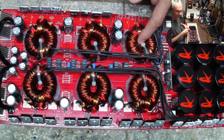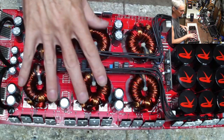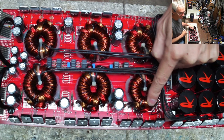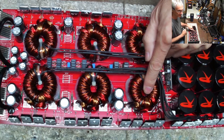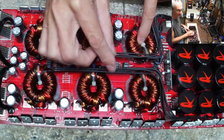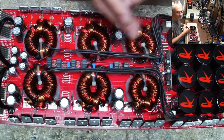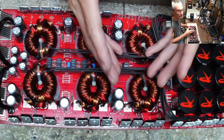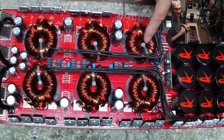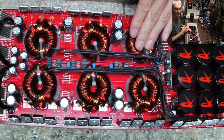For this particular amp, this auxiliary winding is 12 volt. In these power supplies there are six transformers total: four are just your everyday transformers, and two are special. One has an auxiliary winding for your plus and minus 15 volts for your preamp and other sections. This one is responsible for your negative-rail-referenced square wave — it usually has a 12-volt regulator that supplies 12 volts referenced to the negative rail for your gate drivers, which I think is key to my question.